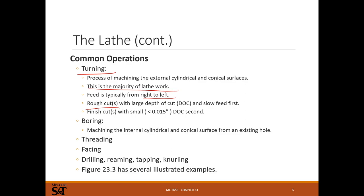You'll usually do some number of roughing cuts depending on how much material you need to remove, where you don't care that much about surface finish - you care mainly about getting material off. If you're going to make some kind of part, you need to remove all of this material as quickly as possible, so you take deep cuts and usually get bad surface finish from that, or you use tools with a more aggressive profile that just aren't capable of leaving a good surface finish.